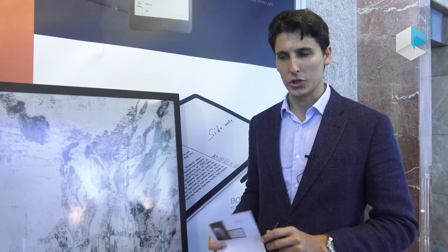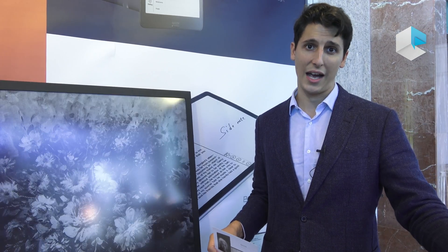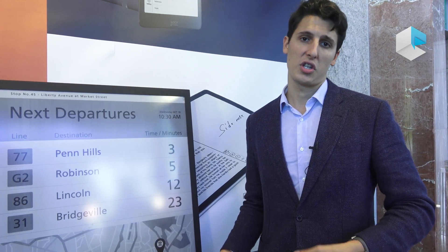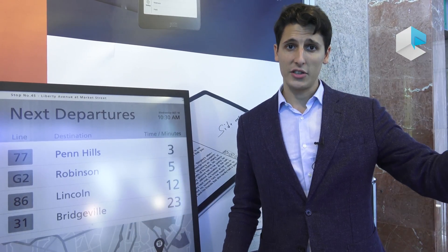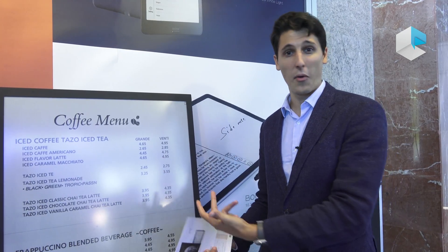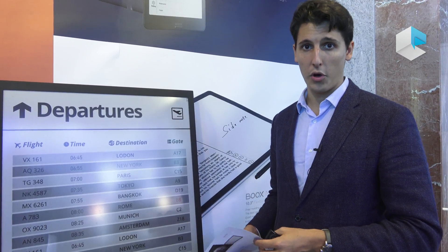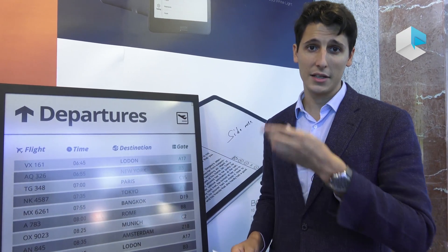Another very important point for this e-ink product with its anti-glare solution is that, as you may know, e-ink devices perform best when there is very good ambient light. So in a scenario where you're using this device outside on the street to show information, because the ambient light is higher, it would be seen in perfect conditions — and it's eye-friendly. Compare this to an LCD, where the LED light comes from inside: the brighter the ambient light, the more power the LCD needs to produce to be visible. So you waste more energy, and if you don't provide that energy, you won't see anything. This is a very good reason to start using this kind of product in industry.